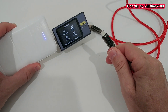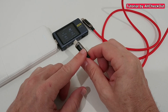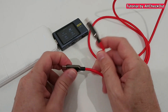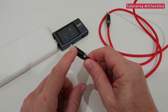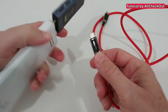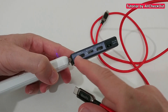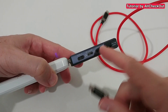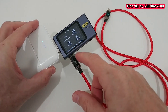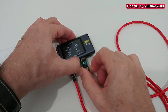To test such a device, you need to think about the input side. Sometimes with these cables, there's a difference when they have a display — you have to start with the side which doesn't have a display. The device doesn't have a description on the back like the FNB48 did; it just says USB-C, but it marks one side as input and the other as output. So I go in on the input side with the end that has no display, and out on the output side with the display end.